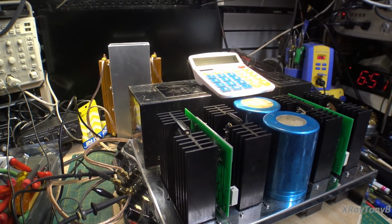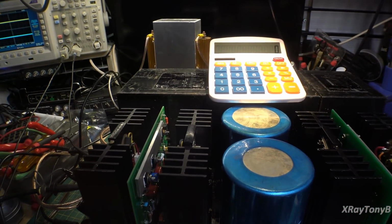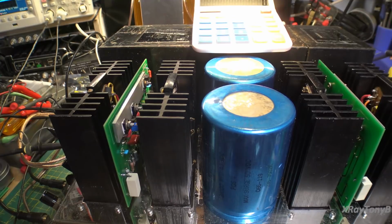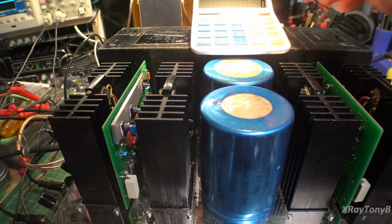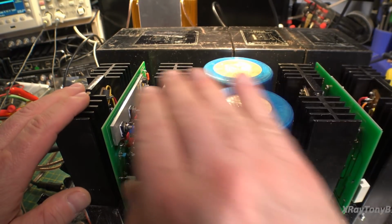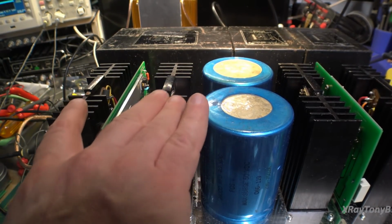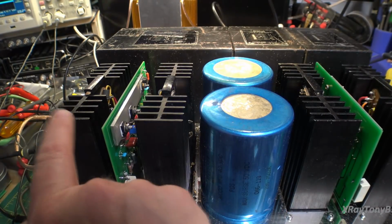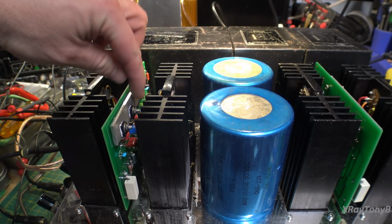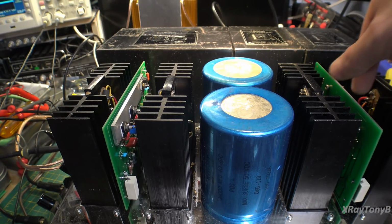But our little board works, and I'm still kind of surprised at all of that. Other than miswiring that one socket, everything else looks okay. We're definitely going to have to do a few more tests on this thing over time, but these are ice cold. I don't have to worry about touching the heat sinks together and getting shocked, because all these transistors are up on insulators now, as are these. And again, this is just barely warm to the touch.